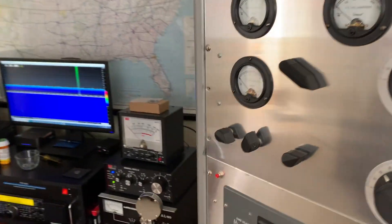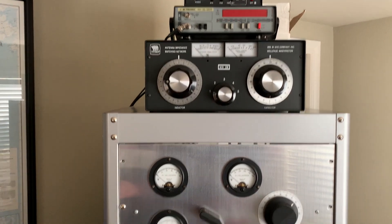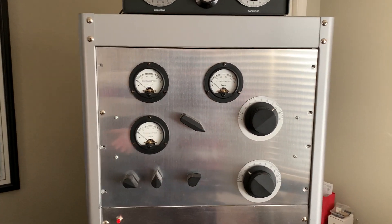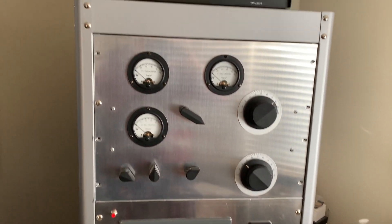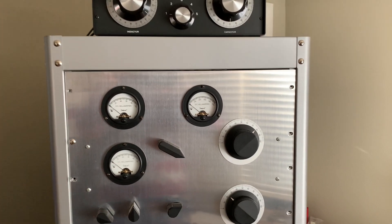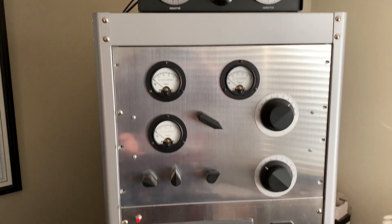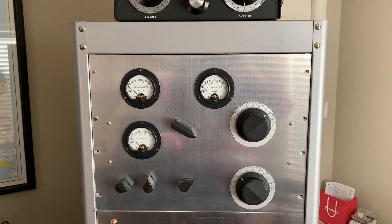I want to see if there's any change in the power output. If not, then there's something else going on. But it looks like it's stabilized now at only about 175 watts. What was happening last Thursday or Friday — I was going to get on 75 meters, call CQ, see if I couldn't work somebody — the power was up to about 200 watts when I first loaded it up. Then when I came in about an hour later it had dropped down to 175. So maybe it's just the tube, but I'm not going to know until I change it.